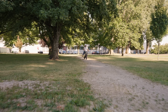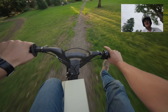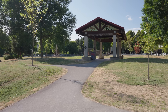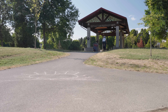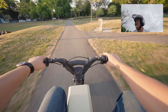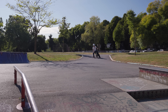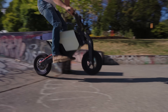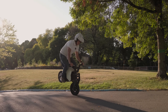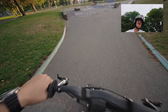Now, aside from making bikes cheaper, 3D printing can also make parts much stronger. We always assume a plastic piece like these big handlebars is solid, but with anything injection molded, beyond a certain wall thickness it has to have an interior lattice with air gaps — otherwise the internal forces are so strong the part will crack as it cools. But with a 3D printed part, you can make it actually truly solid, and the result is a strength far greater than we're used to thinking about for plastic parts.